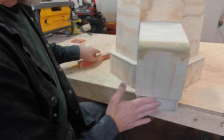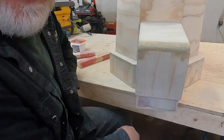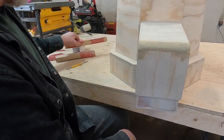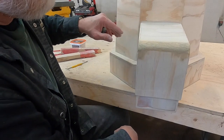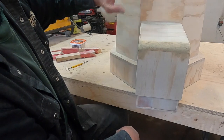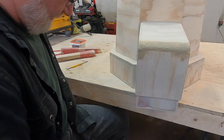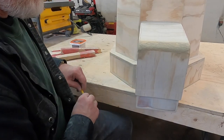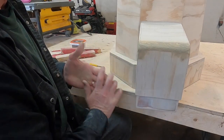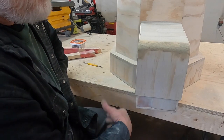Of course, this one doesn't light up at all. The windows don't light up, which would be easy enough to do. The Port Alconey one didn't have any lights in it at all. Pardon me, dust. It was just a complete tapered circular tower, and I had to build this gigantic lathe to do that. It was all made out of 2x6s that were shaved down and made into round, four inch wide tapered 2x6s. I'll show you the lathe.